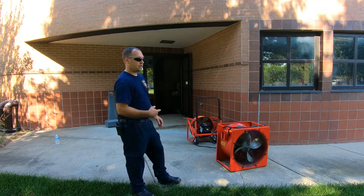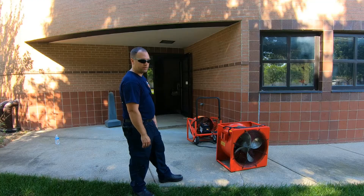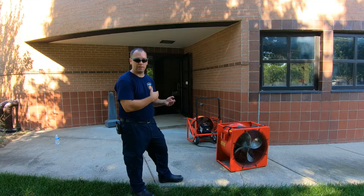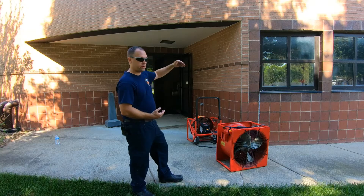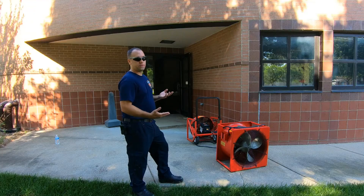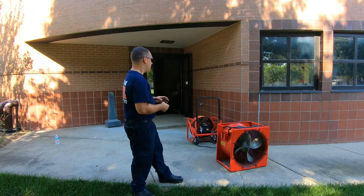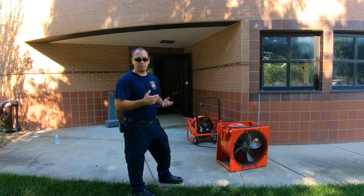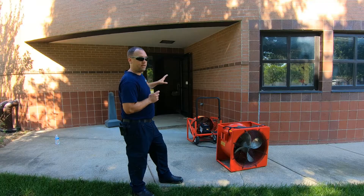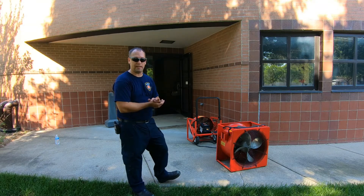While running fans, try opening and closing vents on the far end — open up the other door and see what kind of flow you're getting. Does it change if you open all the doors in the hallway? Does it change how much air is being pushed out on the other end? All those things affect how you get really good ventilation. Today is the day to play with different configurations, different amounts of vent openings, and different options to pressurize the building.